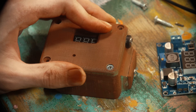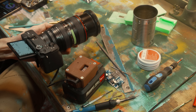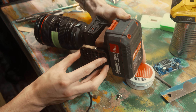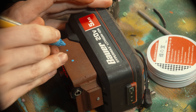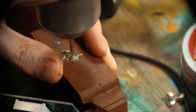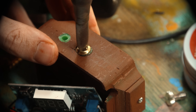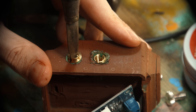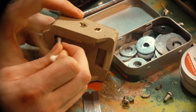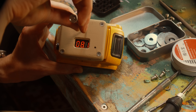I tucked everything into its place, screwed the cap on, and gave it a quick test. It was cool seeing the concept work earlier with just the bare wiring, but having an actual adapter unit now is just so much more solid feeling. Now I just have to figure out a sturdy way to mount the adapter block onto the camera. I'm going to need some kind of bridge plate to connect it to the bottom, so I need quarter-twenty screw holes in the piece. I used threaded inserts — basically just a nut that can screw into a piece — melting holes deep enough for them and screwing them in while still hot. After cleaning those up, I gave the whole thing a coat of ultra-matte sand paint, stuck all the hardware back in, gave the pins a final clean with acetone. My drill battery camera-powering solution is done.